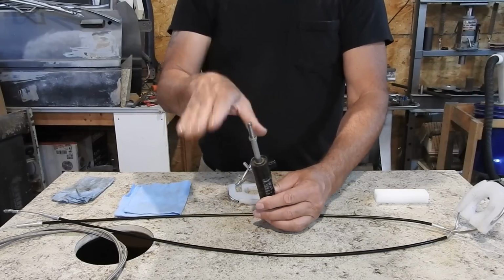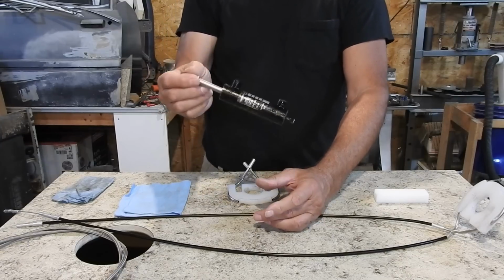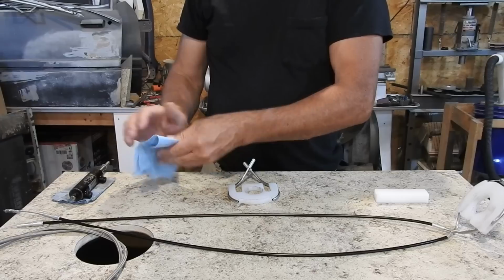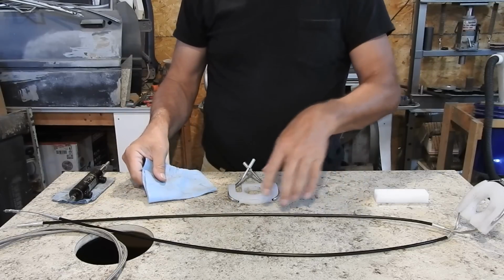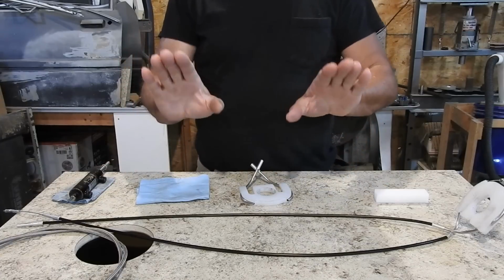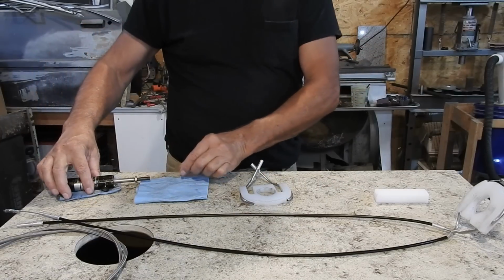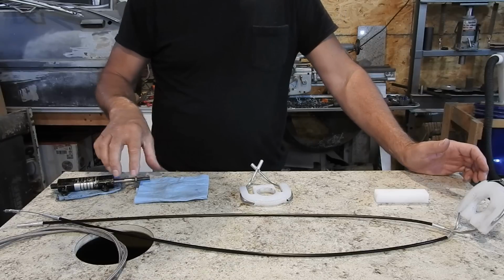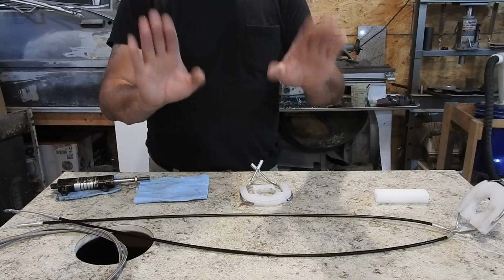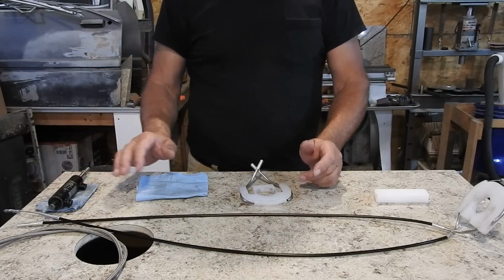So the brakes worked really good. Now they actually move over 1 inch before you can really start feeling the pedal pressure work. These didn't move at all, you know, they were pumped up solid. So I taxied it around Sunday after I was working on this stuff, and the brakes felt much better, but now I had to push the pedals too far and my feet were going too flat. So I had to adjust the fork on this higher. I raised it 1/4 inch, and since there's a 2.5 to 1 in there, that moves the pedal 5/8 inch back on me. So it brought it back to where now it's in a pretty good spot. I'll run it there for a little while and see if that works. But that's where I was at the first half of this video.